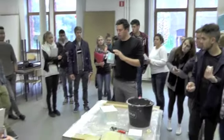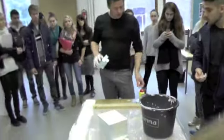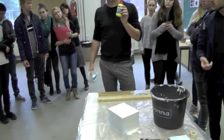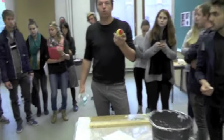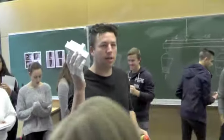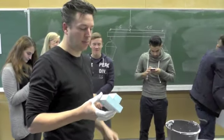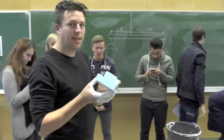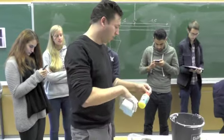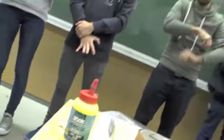Use things like this and they have to stick together because PE isolation is a very difficult material to bond. You can best use a wood glue — it works very well with PE isolation. Don't use the normal contact glue to stick things together because it will heat and melt the material, which is not nice. Just use a very simple glue — I use the one that dries very fast so you can keep working. That's an extra tip to know.